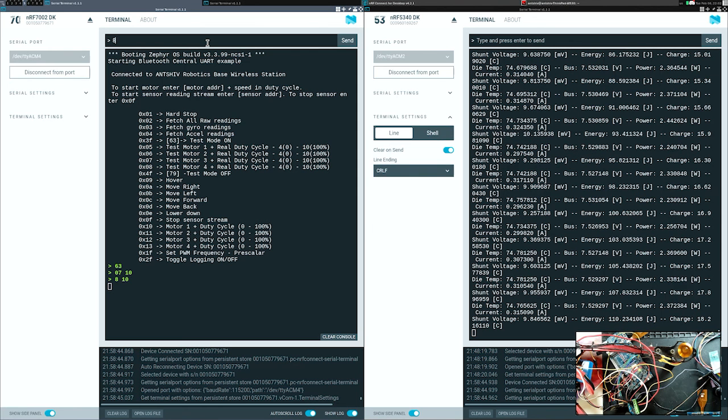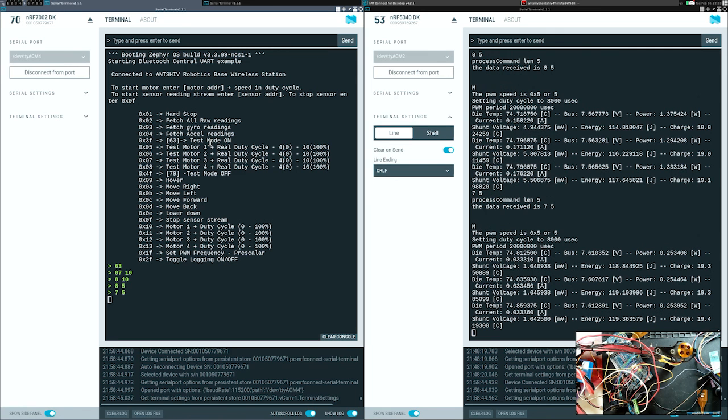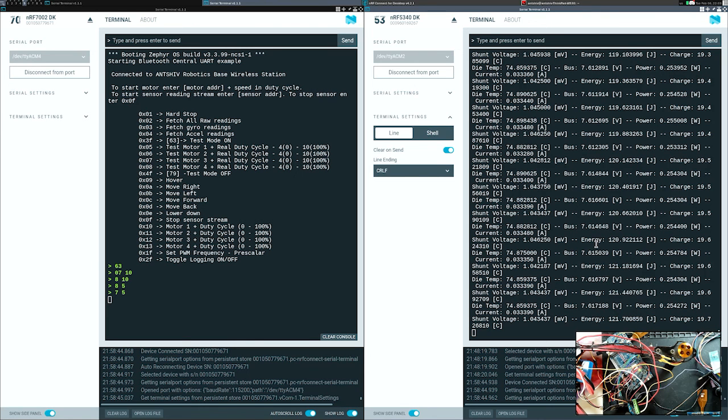This is pretty cool. Now let's switch it off. Is it exactly 2 Watts? I'm not sure — I believe there are some calibration issues and calculation mistakes I'll have to confirm with TI to make sure it's accurate. But so far, the readings seem to make sense in terms of the bus voltage at around 7.62 volts and die temperature at 74 degrees, which we confirmed with the thermal camera. The power and shunt voltage I could verify with a more accurate multimeter. But for the most part, if I increase the number of motors more power is drawn from the system and these values increase proportionately, so there's definitely that correlation.